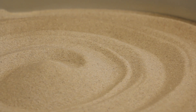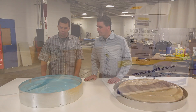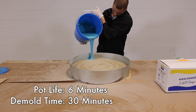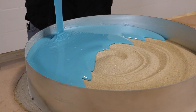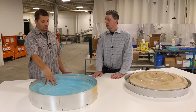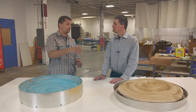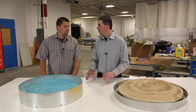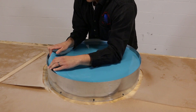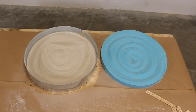So now you have your idea of your sand, it's sealed, and you poured rubber. We chose Moldstar 16 to start because of its fast curing time — the pot life was very short. We figured that being the sand so porous, if we had a rubber that would sit on there for a long time before it cured, it would absorb into all the porosity. But being that it's only six minutes, it allowed us to make a mold, capture all the detail, but not have to worry about the rubber soaking all the way through. It was very easy to demold afterwards. With silicones you don't need a release agent, which was another benefit, and it turned out to be a fantastic choice.